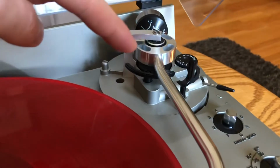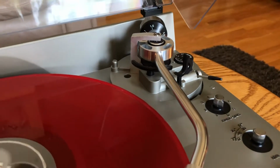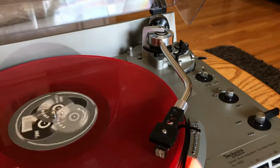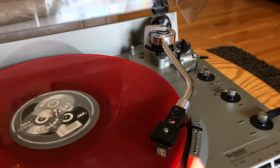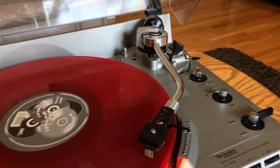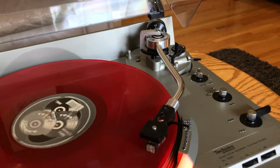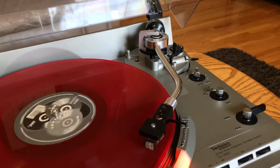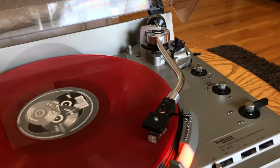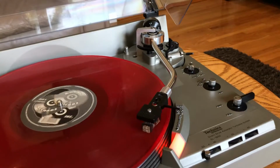Other tone arm mechanisms weren't working properly. This is extremely common on any Technics of this era. It was not entering the turntable platter as it should because stuck old grease was in the way. So I opened it all up, took the base off, everything, flipped it over, and removed the whole tone arm. The assembly was completely taken apart and lubricated as it should. And now the turntable performs flawlessly and enters and exits the platter as it did in 1976.